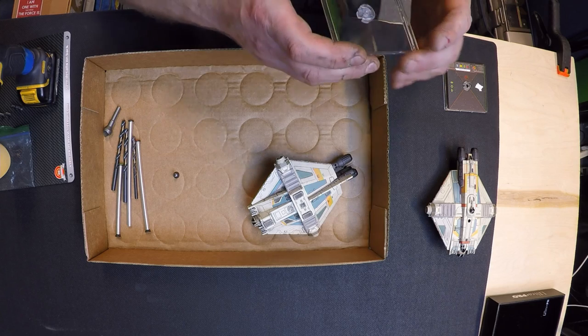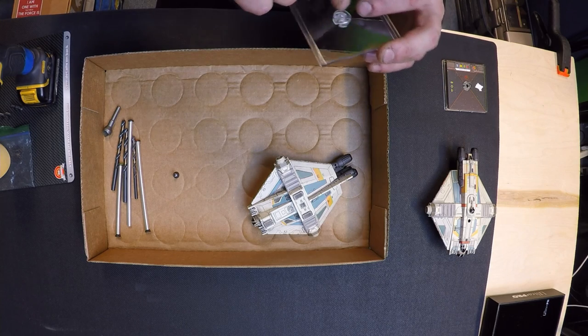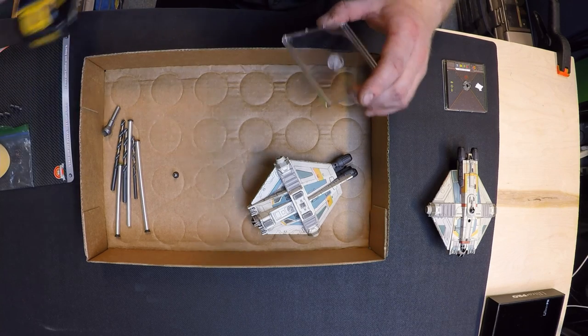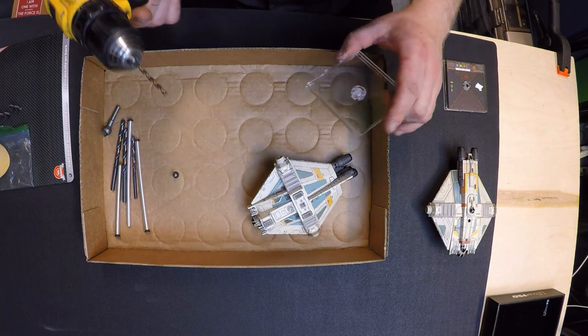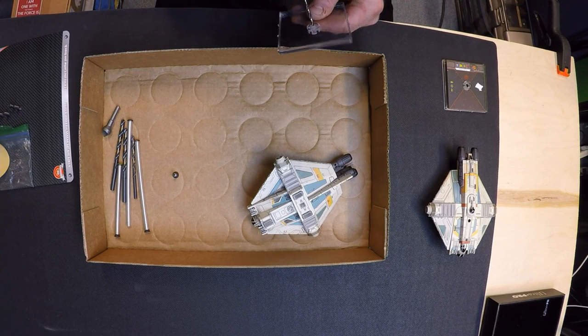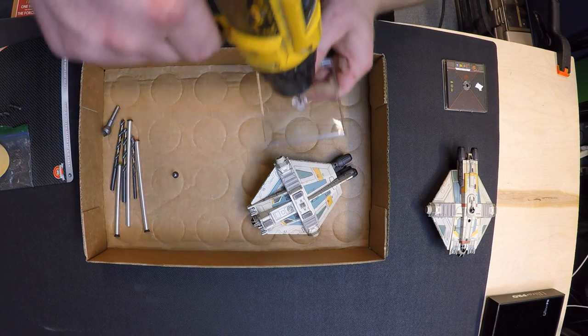On the backside — the bottom side of the base — find the center where you would normally put your peg. I'll take a one-eighth inch drill bit and just drill right through the center of it. You're drilling on the bottom side, all the way straight through.